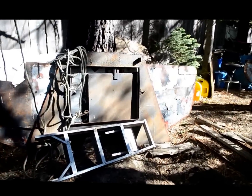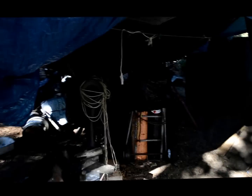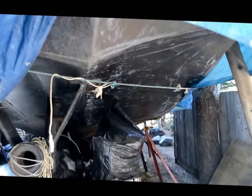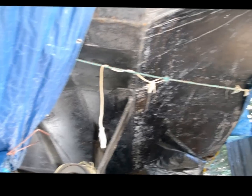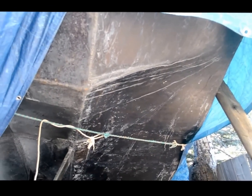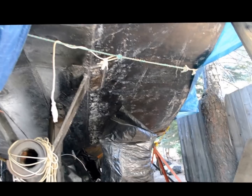Some of the steel that was removed from the hull — shaft log. You can see some of the re-plating my father did on the stern area here. It was a tunnel stern, as you can see, and it used to go down more and then flat on the sides. But he had to re-plate it anyway, so he removed all that material and modified it to more of a fantail.